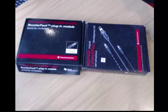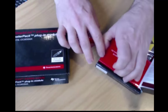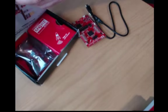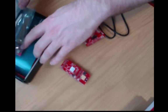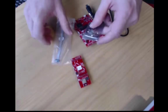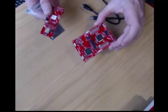Here are the two development kits that you need. First, the MSP432 Launchpad with a USB cable. Then you have the CC2650 module Booster Pack. In this kit you will also find a module sample and a small debug cable. This cable can be used to debug on the module directly — there is a connector on the module and you can use the debugger on the MSP432 Launchpad for this.